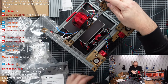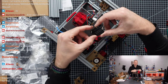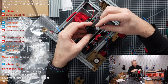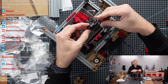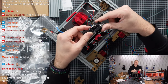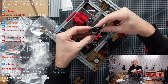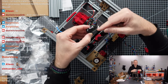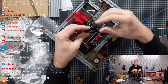The Picobilical PCB is an intermediate PCB where, first of all, the plugs from, for example, the motor and anything else, like the sensor and the hot end heater, everything gets connected to this little PCB board first. And then there's a huge cable that has all of the pins required to drive all of these individual items, going out in one huge string back to the main board.